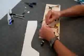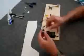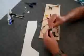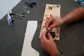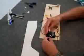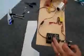handy. So the first thing we'll do is hook up the servo driver, and this you can actually take and cycle the servo at different speeds. So if you want to break in a servo, you can do that, or you can test it to make sure the gears are good. What I use it for primarily for model setup is when the servo is centered digitally, this light will come on, and I don't know if you can see that, but on the servo driver, when this light's on, the servo is centered digitally. So what you want to do is make sure your servos are centered and put the horn down 90 degrees.